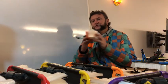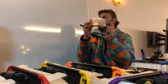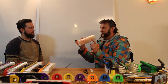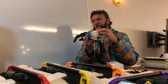In order for the speed of the water that's hitting the glass to not bounce? No, because you've taken the brush so far away from the glass, and now you've got an off-glass rinse. So you can't have it just squirting this far. So if it's only squirting this far with pencil jets, you'd say that's not far enough. But with Constructor, if it squirts this far, it's perfect because it only has to get over the top of